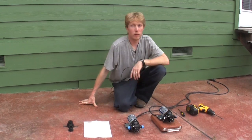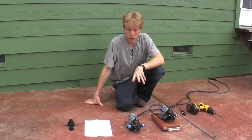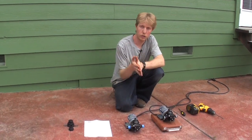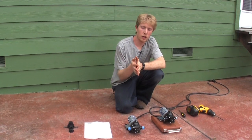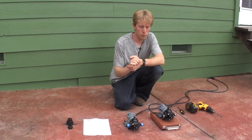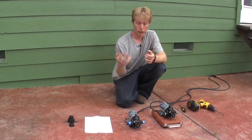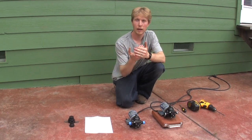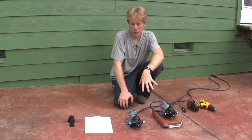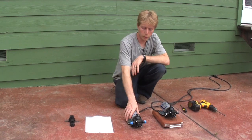The BioBrewers are designed to work with a variety of SureFlow diaphragm spray pumps. We've selected these pumps specifically because the diaphragm motion — which works similar to an accordion — is very delicate on microorganisms and tends to do the least amount of damage, versus a propeller-driven pump where microbes passing down the tube and impacting the fast-spinning propeller can do a lot of damage. These pumps have been tested to do minimal damage, and SureFlow makes a variety of them.